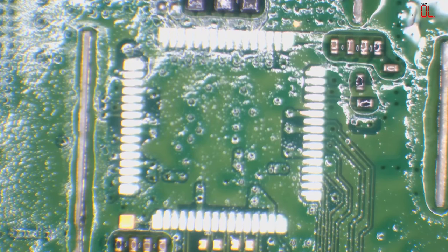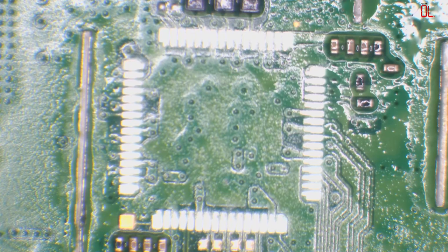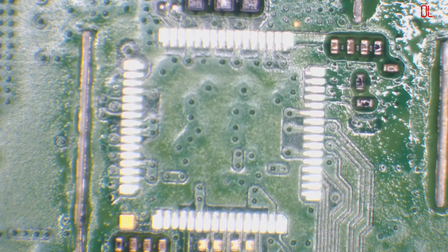And other times they'll die because the console's overheating and the chip gets too hot. Because if you think about it, every chip, every component has got a minimum and a maximum operating temperature. Normally, it's around about -5 degrees to +105 degrees Celsius. That's normal operating temperatures for most integrated circuits.